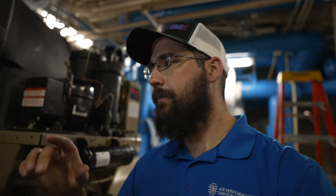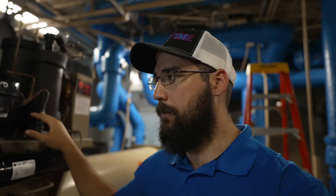We're working on this chiller startup and while we were going into the startup process we were having some trouble with it surging, which we expected initially at least. We had it running on pump out overnight, but when we came in this morning the suction line temperature on the pump out was actually looking pretty good — it wasn't showing any issues or reason for concern, but we were still surging.